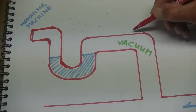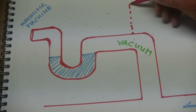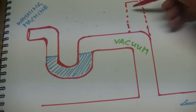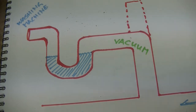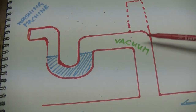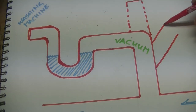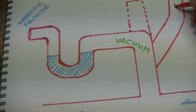Poisonous gases can actually enter into the room. What I should be doing is putting in an air vent system like that, so when there is a vacuum it will just draw air in from the top and it won't siphon the water out. But because of the proximity of the electrical socket I want to take this right away from the corner.